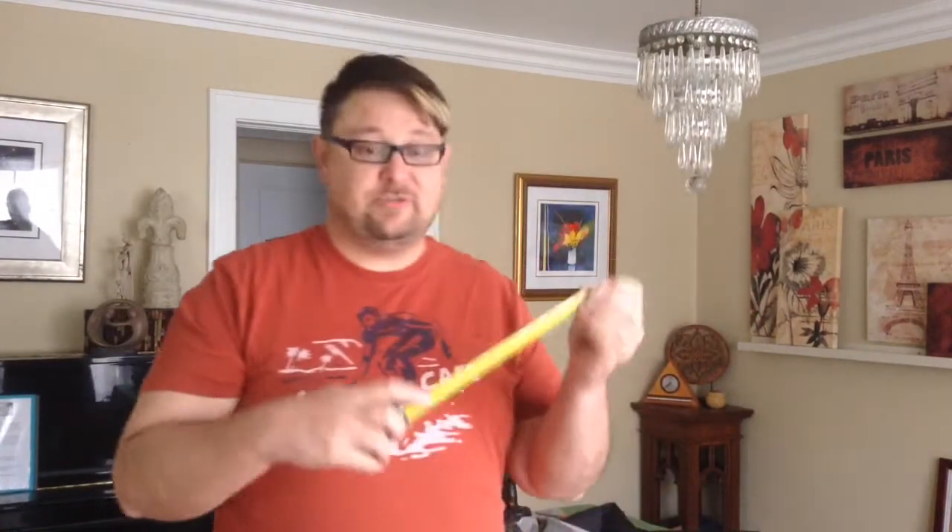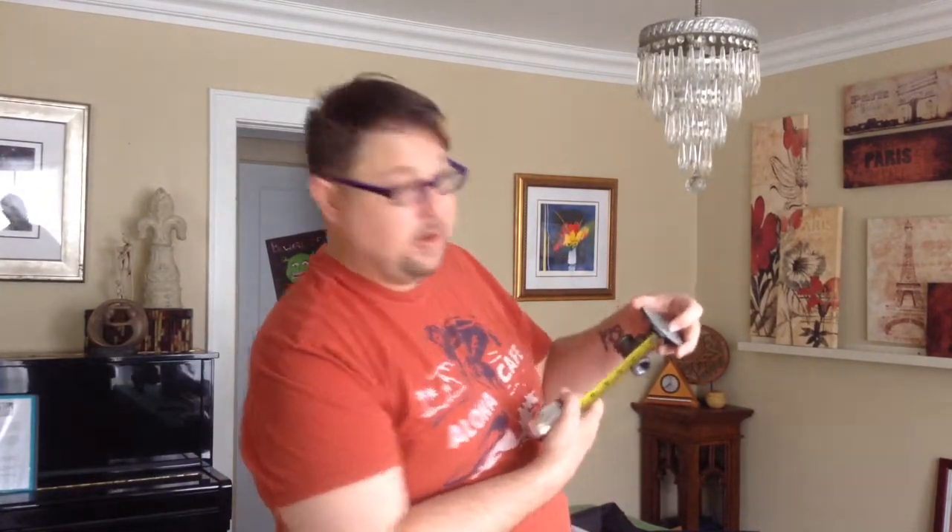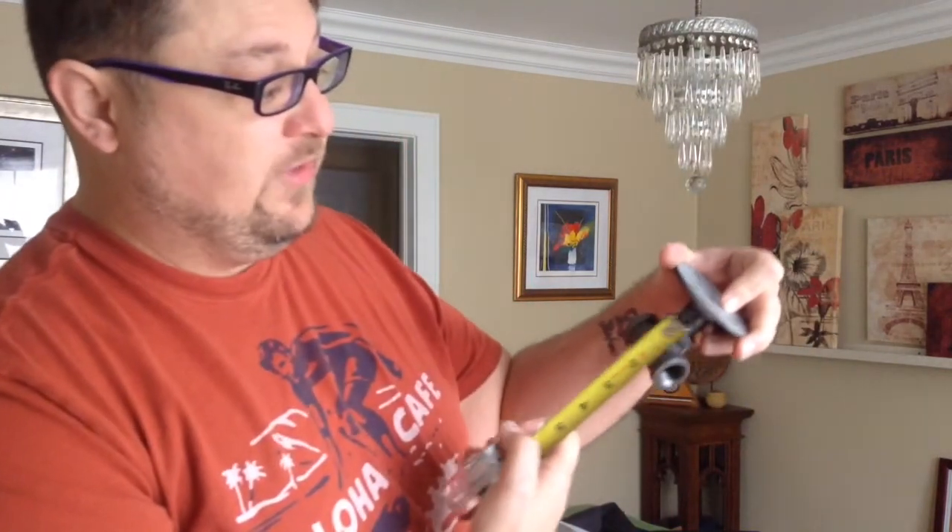Now here's where the adjustment goes. Take your tape measure and basically measure this distance right here between the floor flange, the T, or the elbow. Make sure that is the same every time. So here I am in my living room and the first thing I'm going to do is actually attach the T. Then I'm going to attach the spans that will have already included the elbows and the other floor flanges. And then that way I can screw them in and adjust as I go right on the wall.